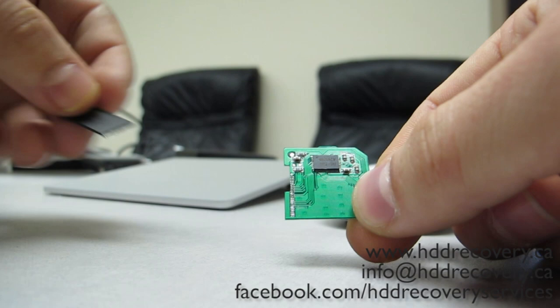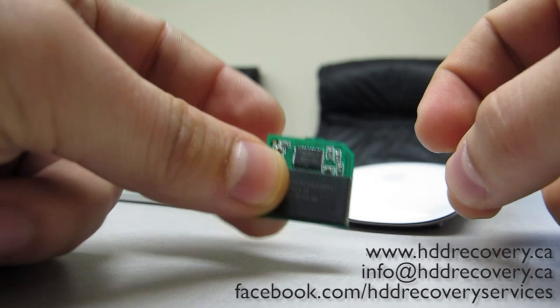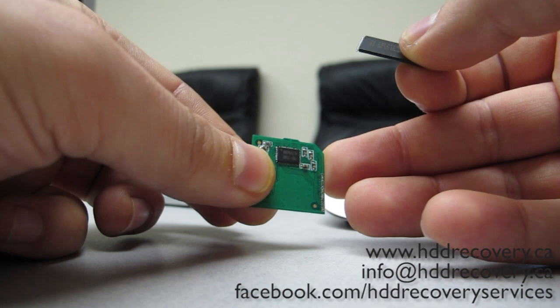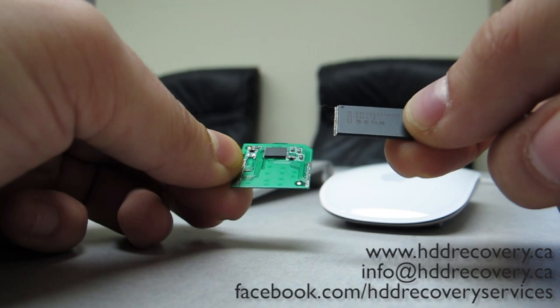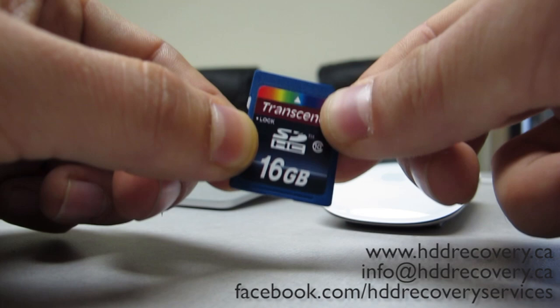So when that controller fails, the NAND chip becomes useless on its own. In this kind of setup when it's all put together and you plug it in, we have to remove the NAND chip and substitute the controller with our equipment that can replicate its function. By adjusting an algorithm that functions as such a controller and combining it with the image we took from the chip, we should be able to restructure the contents of this card.